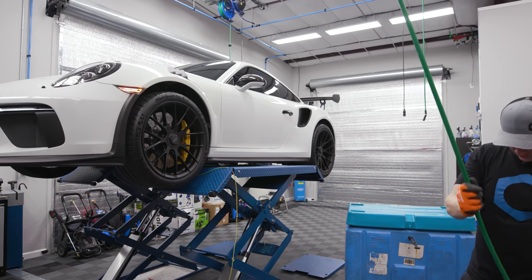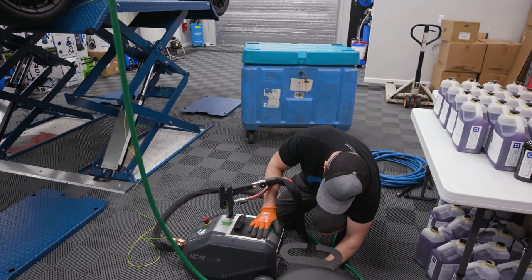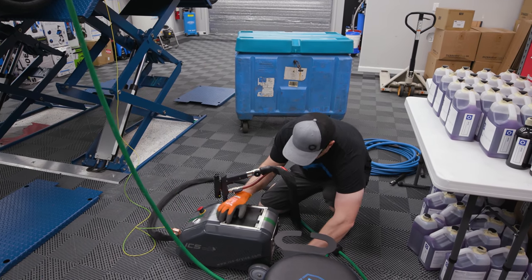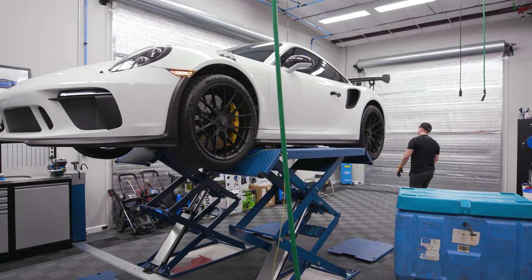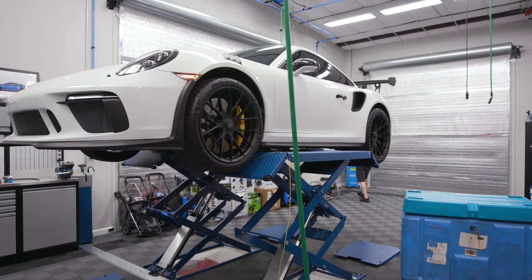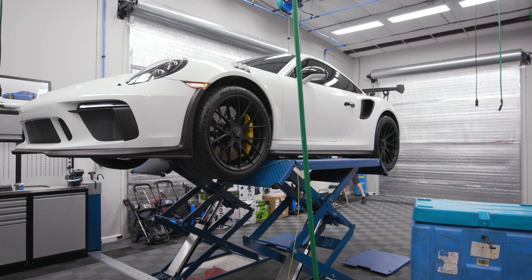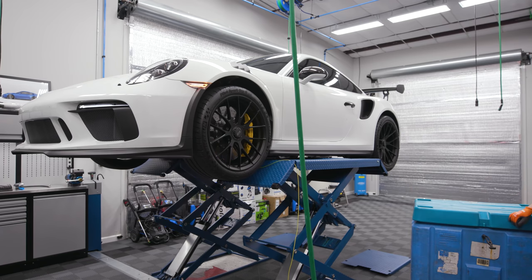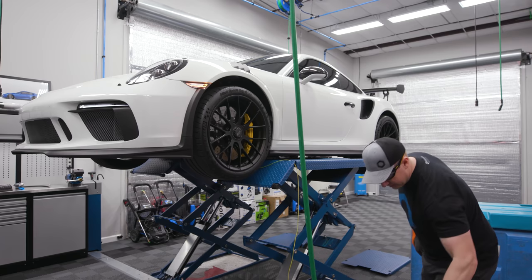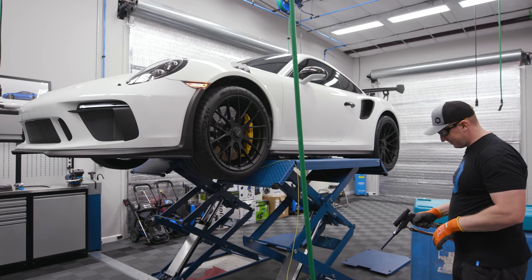So there's no electric, just air. And so I'm only delivering it like 12 CFM or something like that. Let me go check my regulator and see where I'm at. Make sure I got this thing cranked all the way up. So this is only a 3-horse rotary screw. I'm gonna work it as hard as it could possibly work. The compressor next door I have is a big boy. It's a 30 CFM machine. Let's turn our flashlight on. Oh yeah, like that.